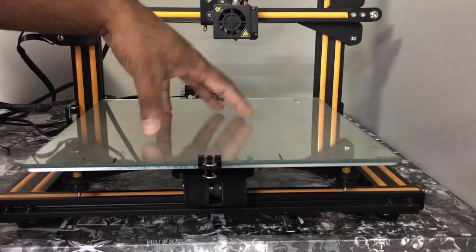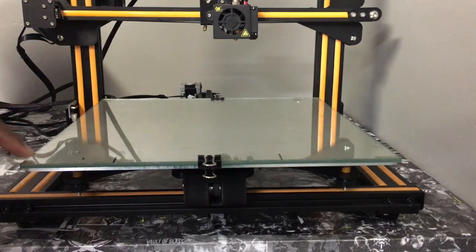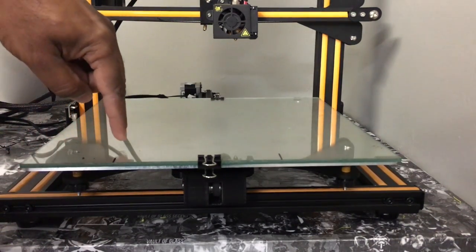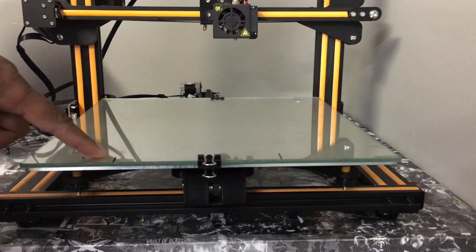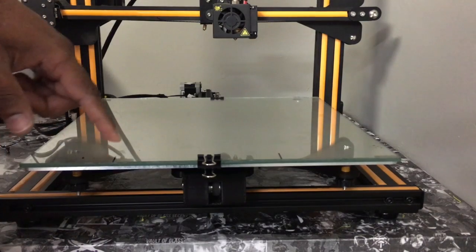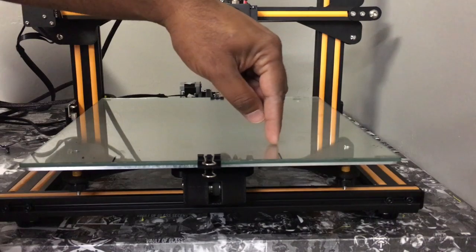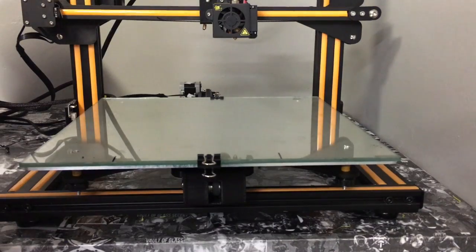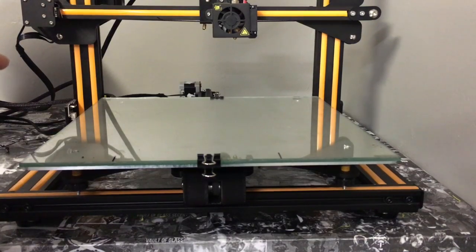What you want to do first is normally you have your glass plate on here, then you auto home your nozzle and it comes right over here, and then you're going to level your bed. You're going to level it here, here, and keep going down little by little until you feel that the paper is no longer grabbing. Right when it starts not grabbing, that's where you want to make a line. You keep leveling all four corners first — don't worry about the center.